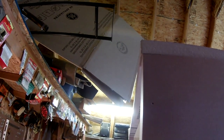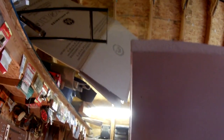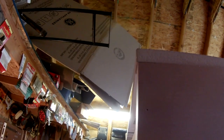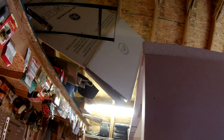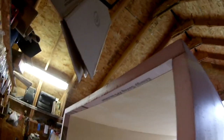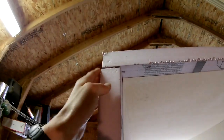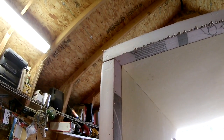Well, I would venture to say that the sidewall is probably just a little short up there. So, like I said, not a big deal. It's just going to require a little sanding when we finish up our outside. So I'm not going to worry about it, and you shouldn't either. The sides are nice and flush, so we're going to go ahead and do a glue up then.